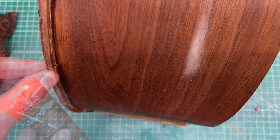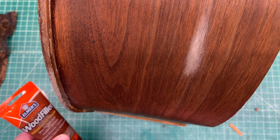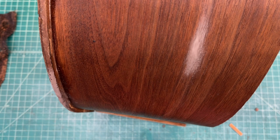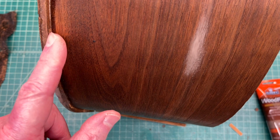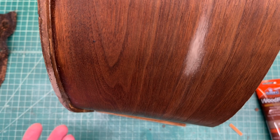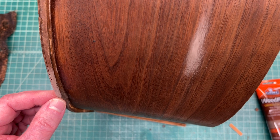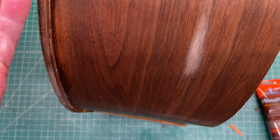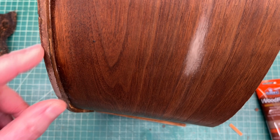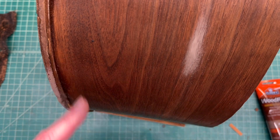And I think this piece of veneer actually ran this whole backside perimeter as such. So a practical approach, I think in this case, I'm going to just use a wood filler, probably this walnut based that I have here, that I've had for a while, and just fill this void in while I'm also working on this outside edge piece that's got numerous holes and gaps in it as well. And then do some light sanding around that area as well. Try to minimize any distraction to the grain of the wood here on the top itself.